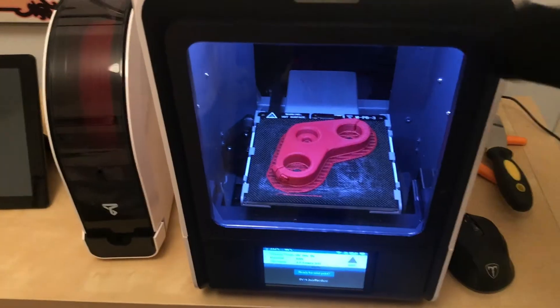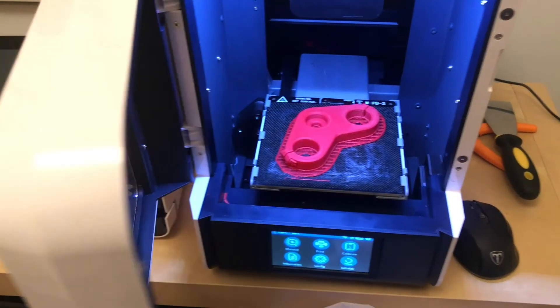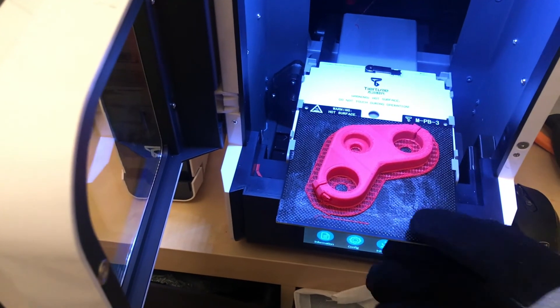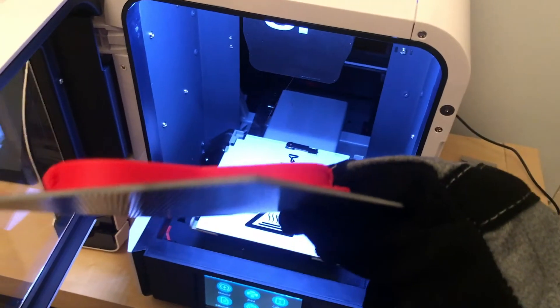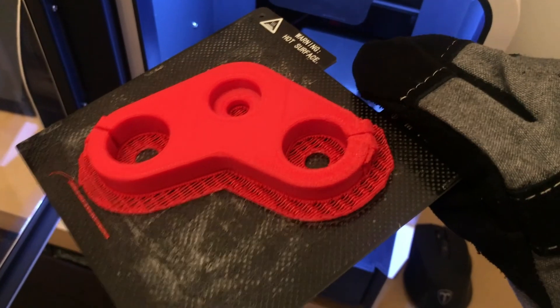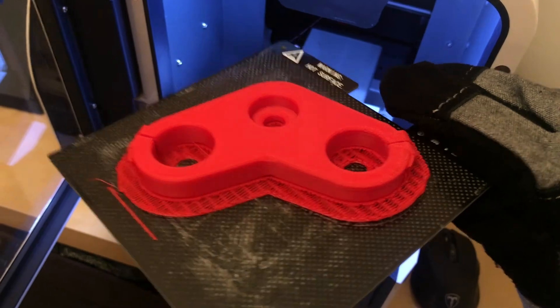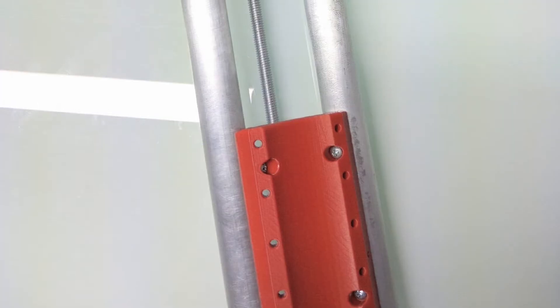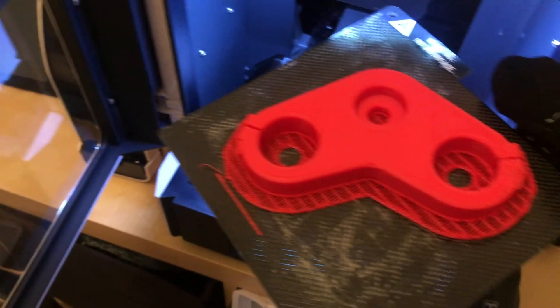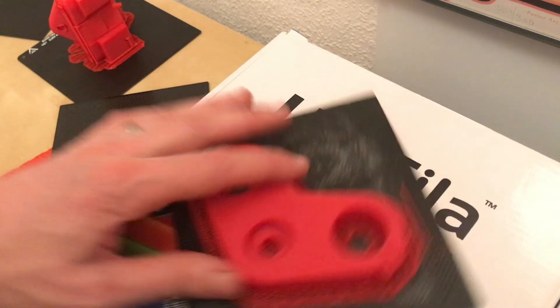So here we go — this is the semi-successful Z-mount. It's stuck well enough that I can pull the board out, so at least it's adhered to some degree. You can see there is quite a bit of lift there, and as a result we've got a really poor surface on the top. The way this part actually works on the MPCNC, it's got these two holes for fairly substantial rails to go in there, so I'm hoping that when I put this in place the rails will give some additional strength to the part and hold it in position.